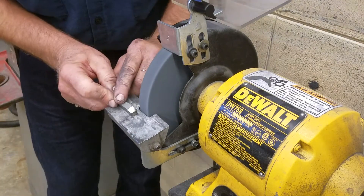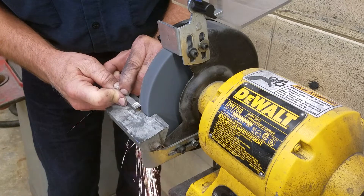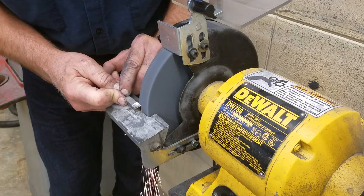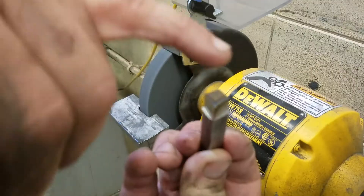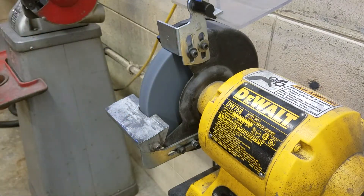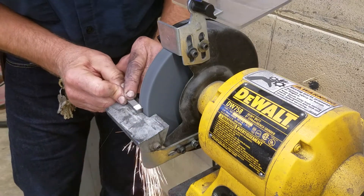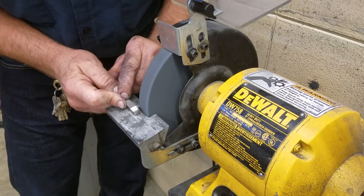It's getting a little bit loaded so we pull it off. This is not tool steel — remember, this is common steel, just for practice. That looks pretty good. I do see a little bit of flatness on the nose — there we go, that looks pretty good. The tool bit always stays flat — always, always and forever. This thing stays flat.